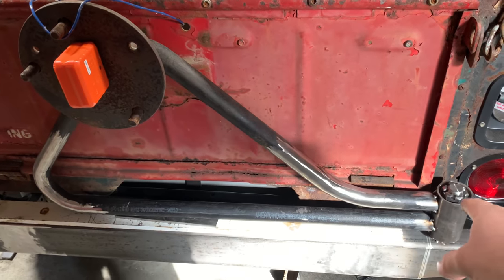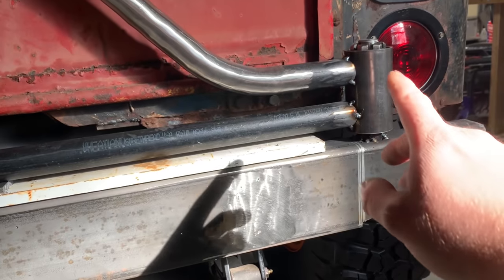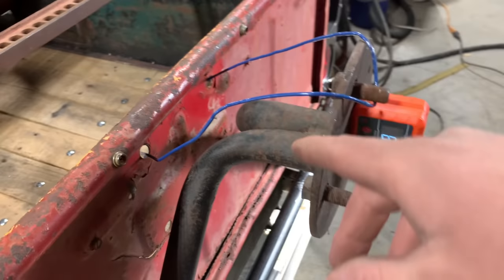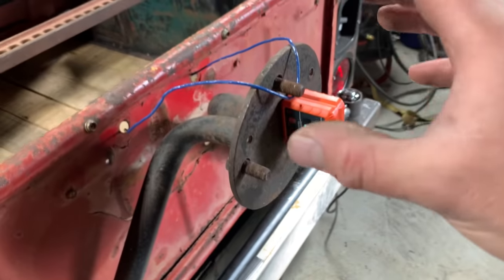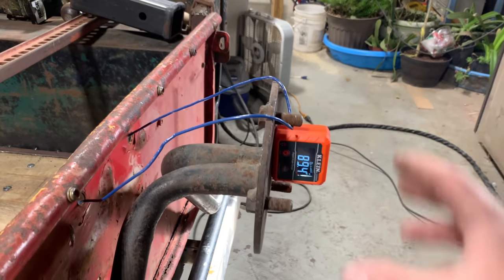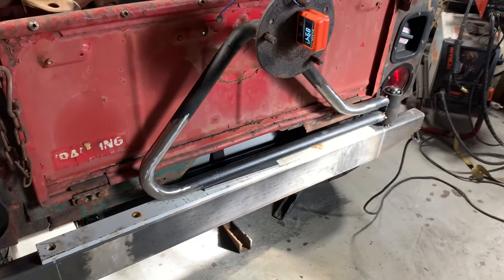So I coped the ends and got those right where I wanted them. That was pretty easy. Then I had to stack a couple pieces of metal, so I got that pretty close to right in the middle of that spindle. I just wanted it to be symmetric. Then up here, y'all can say whatever you want about this, but it worked. I took this piece of wire and ran it through them holes in the tailgate, twisted it, and worked it until I was right near 90 degrees, which is close enough for me, because there's no guarantees that plate's perfect either. I went ahead and put me a few little tacks down there. So let's go ahead and pull these shims out and we'll see what happens.